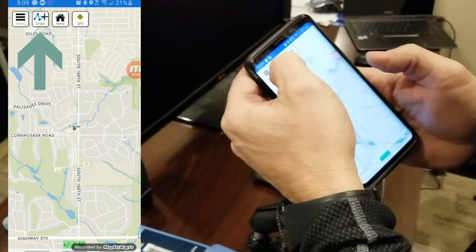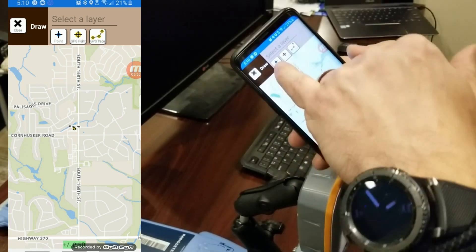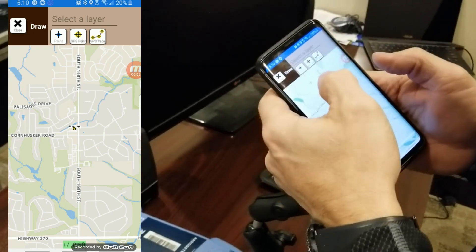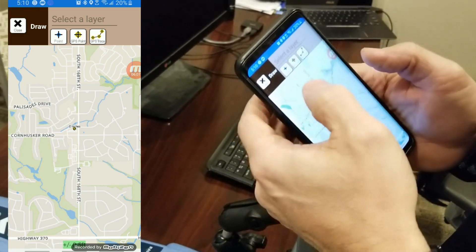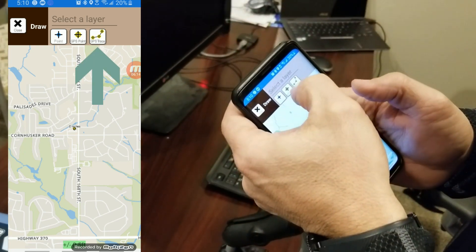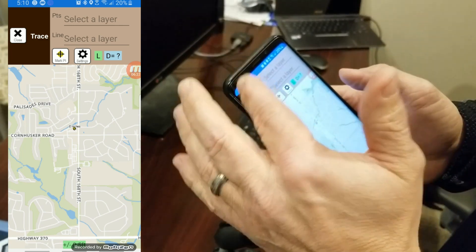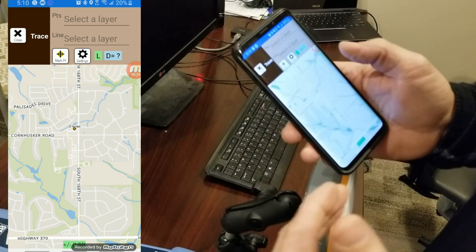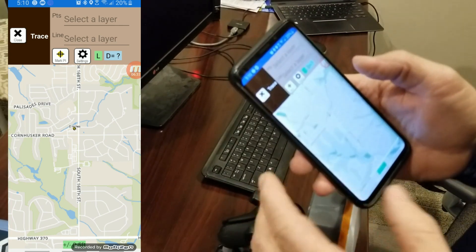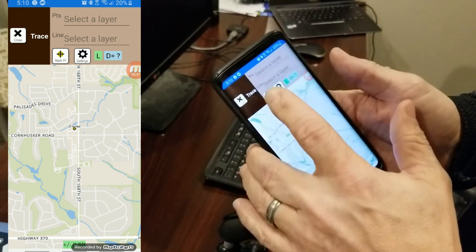Now I'm going to make sure the locator is speaking. There's a Draw button on the top left-hand corner. Clicking on that allows me to draw to whatever layer I want. I have three options: the first is a blue icon which lets me draw a point anywhere on the map; the next is a yellow crosshairs icon that hones in on my location so I can draw a point where my GPS says I'm at; and the third is called GPS Trace. When I click on GPS Trace, the nice thing about this app is it allows you to draw to a points layer and a line layer at the same time. Not only will it save the points, location, depth reading, and all the data the locator spits out, but it will also draw a line. And when you're done with that line, you can start a new line immediately without interrupting anything.